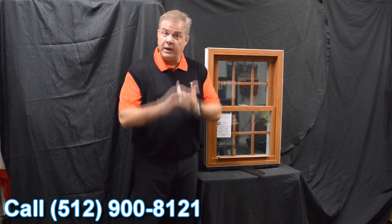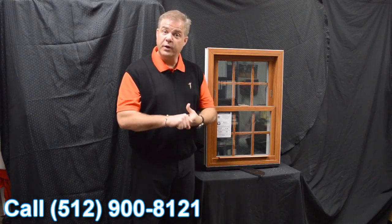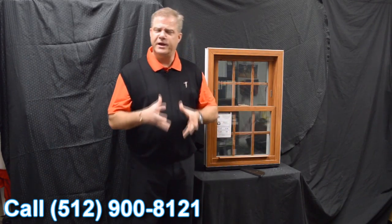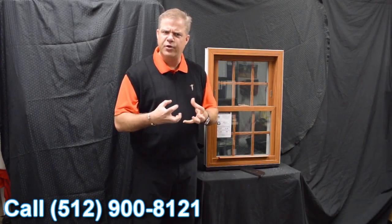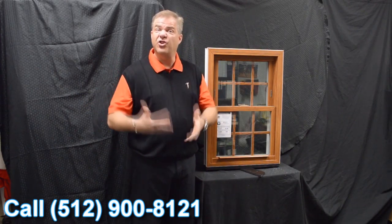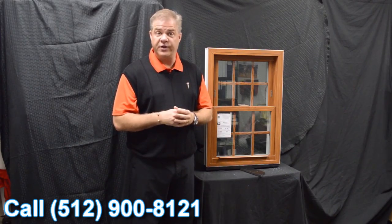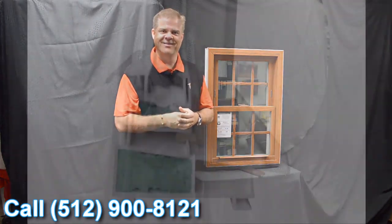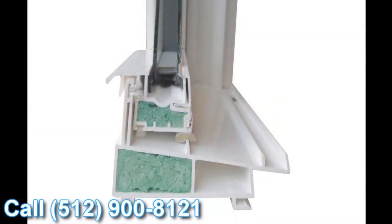The final characteristic that I wanted to discuss on the Lotus window was this fiberglass reinforcement, which is standard on the window. So let's summarize that meeting rail: we've got an interlock, we've got the delta lock, and now we've got fiberglass reinforcement as standard — so that draws everything together, and that's why this window features a 0.06 air infiltration rate, which is well below the industry standard.